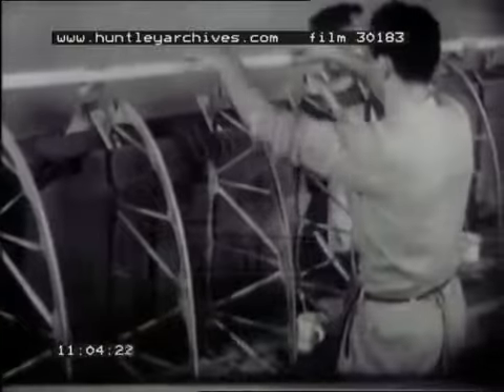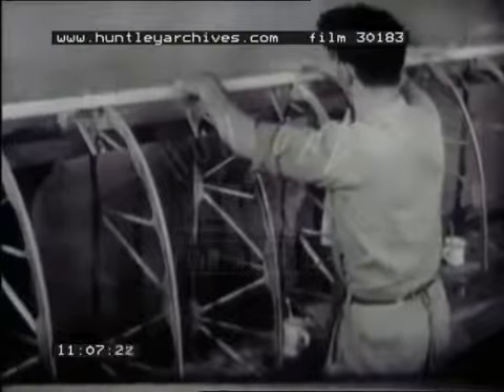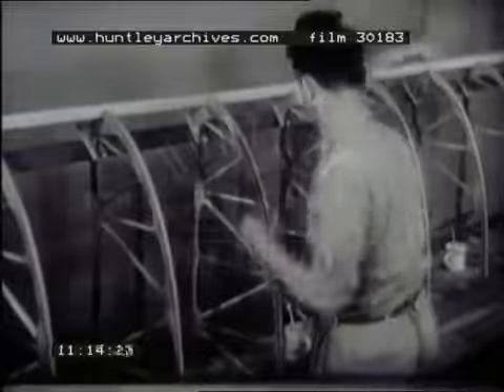Make sure that glue is applied to the entire surface of each notch. Wipe off the surplus. When making this fit, be careful to work it into all of the notches at the same time. Use a wood block to tap it in and to prevent damage to the strip. Again, wipe off the excess glue that is squeezed out.